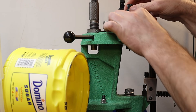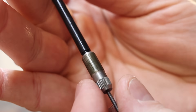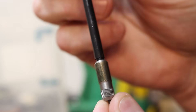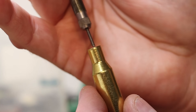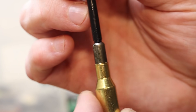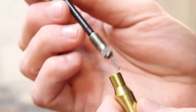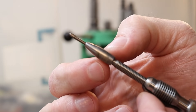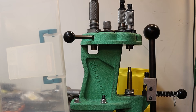One thing I hate about Redding dies: the expander has really no taper to it — a lot of other dies have a tapered portion where if you've got a janky neck that needs ironed out, it has a smoother way to do it. These are kind of an all-or-nothing situation. It's a pain. Here's one from a Hornady die — nice taper on it. No matter how jacked up your case mouth is, it's going to be able to straighten it out. That's what I'm trying to be careful about.